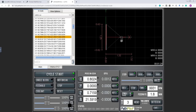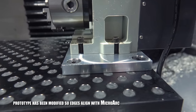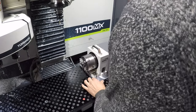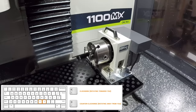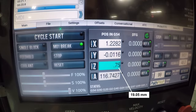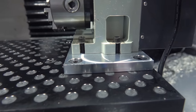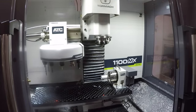We can even get a visual simulation, which is absolutely awesome. We've got the MicroArc on the new Saunders subplate, which includes a reference surface to locate it relative to the fixture plate — a repeatable setup that makes it easy to lift on and off with one hand, add 4th axis capability when you want it, and remove it when going back to a 3-axis machine. To jog your 4th axis in PathPilot, use the comma and period keys on your keyboard. We'll use a Haimer to find the center of rotation — I'm cheating a bit by finding the top of the 1.5-inch raw material and telling PathPilot that's 0.75 inches high, putting me on centerline. If you use the subplate for repeatable setups, you can save those Y and Z offsets so you don't have to re-indicate every time.